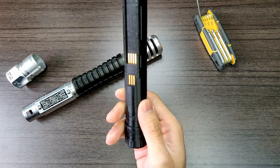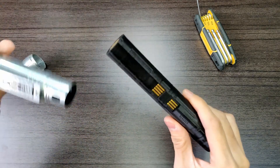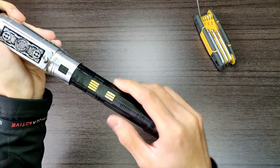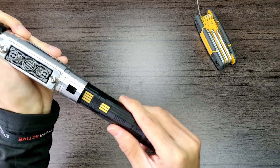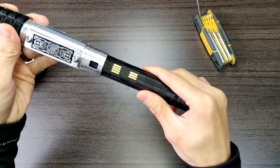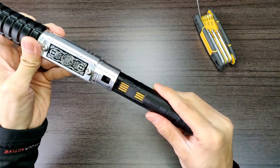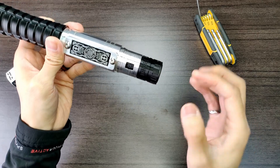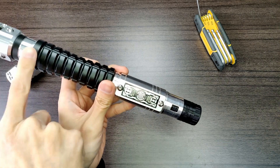I need to adjust the volume because I cranked it really low just to play around with it. To insert the chassis, make sure that this guide over here aligns with the control box. Try not to touch these gold contacts because it is wired up for touch control. If the chassis is slightly misaligned it's not going to go in, so you want to make sure that it aligns with the control card as well as this cutout over here. When inserted all the way, you're going to feel a little bit of a spring because there are pogo pins in here to connect the chassis with the emitter.